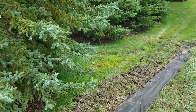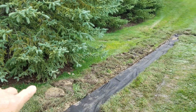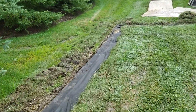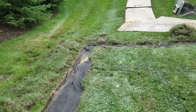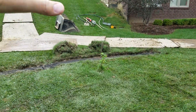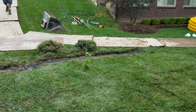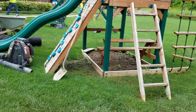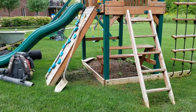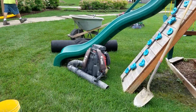The neighbors actually caused part of the drainage problem here because they planted a tree in the swale. We went ahead and are helping to evacuate the water quickly. The French drain runs across to catch all the water coming down this slope before it saturates the yard and leaves this play area with standing water where the kids can't use it.